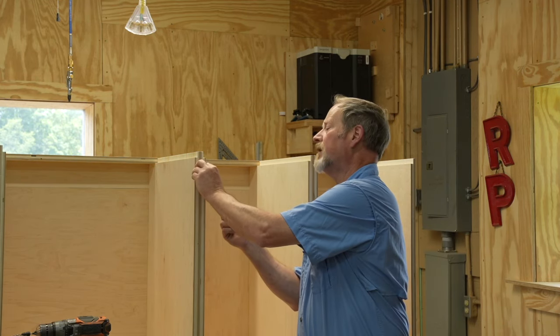These have to be assembled in the upstairs room. They're just too heavy and too large to carry up that narrow winding staircase. So we're going to keep them in three pieces, but they have to align perfectly because the rails that go across must line up. These are inset drawers — the overlays will illustrate any misalignment completely. So we have to assemble them here, disassemble them, and assemble them upstairs with precision. We're going to use screws — a one and a quarter inch going in this way, and a contrasting screw on the other side, so we have two going in each way.